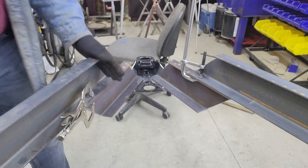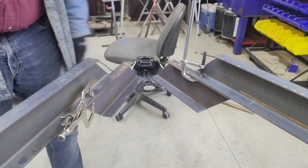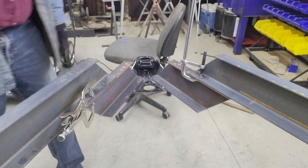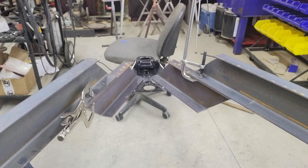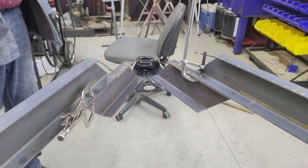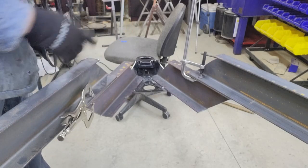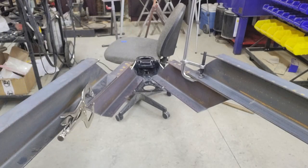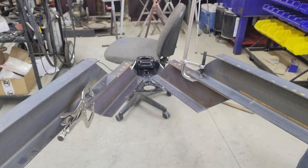I might cap the ends to make it look a little nicer — maybe, maybe not. There is room here because there's going to be a triangular-shaped tongue box that goes in here for storing chains and those things. So those plates are actually about the next pieces I need to cut. Since the corners are 45 degrees they'll lay in there at 45, which makes the top and bottom cuts 45. I think I'll cut those 45s first and then lay them up there and scribe the line on the bottom part.